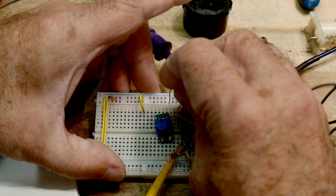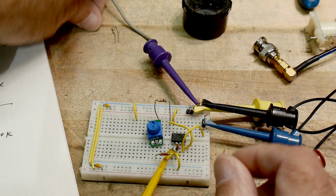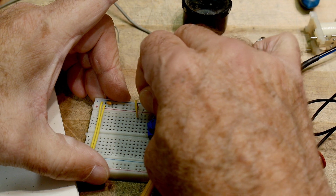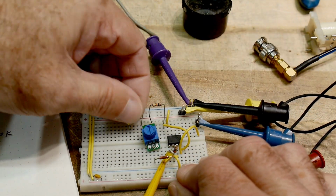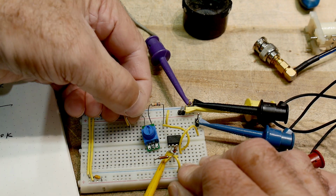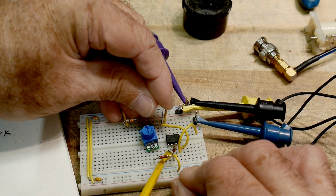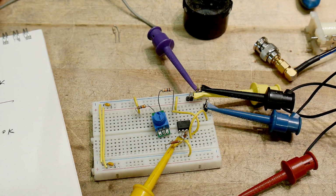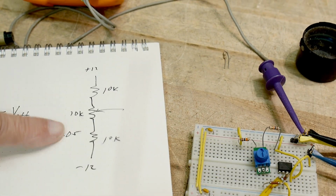Okay, so we're going to go to Rev B of the PC board, and this time we're going to put in these two resistors. That adds very, very little cost. Now you might say, well, just make it a 10-turn pot. Well, those 10-turn pots are expensive, right? And two resistors, that's basically free, okay? So now I've changed it into this circuit.